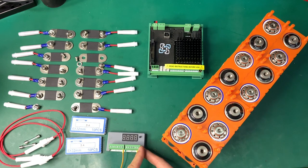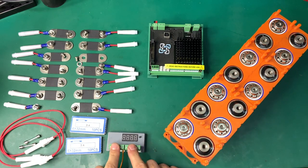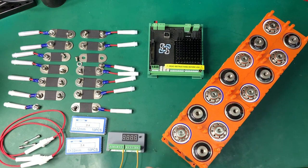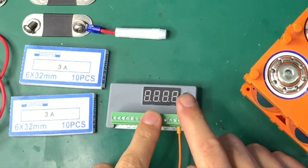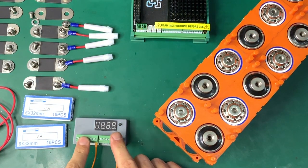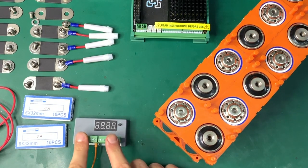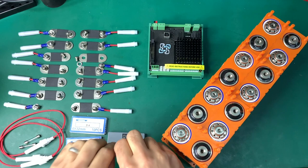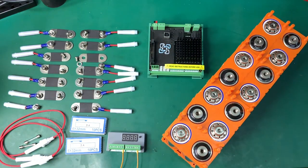The test device checks from the lowest voltage side of the pack — the negative — incrementing through series one, two, three, all the way to the highest voltage. It's almost foolproof: if you plug the connectors in the wrong order, it won't give you a pass message. Once you get a pass, you unplug from the test device and plug into your WatchMon 5.